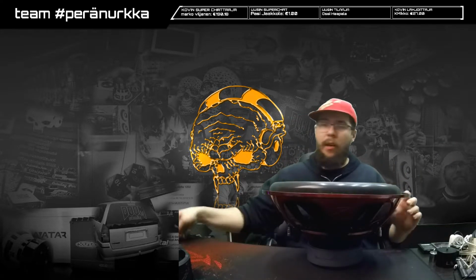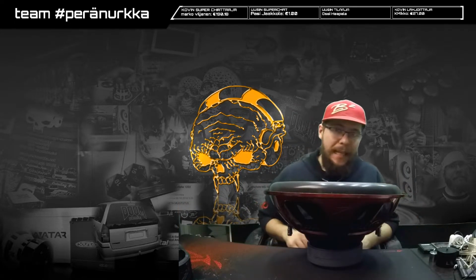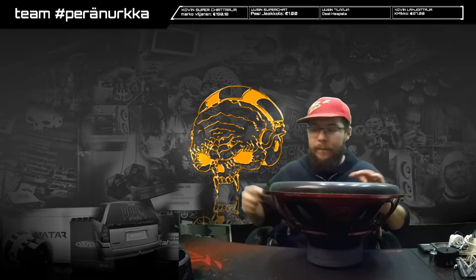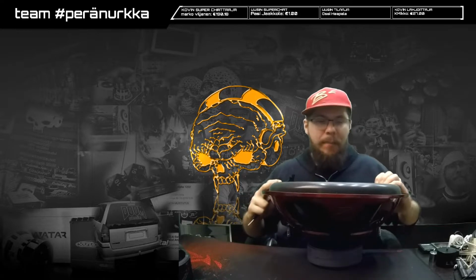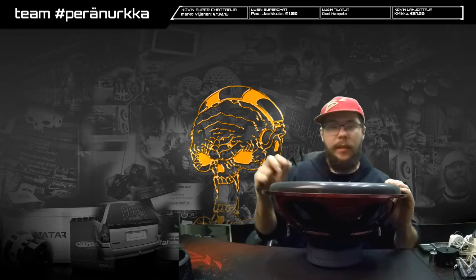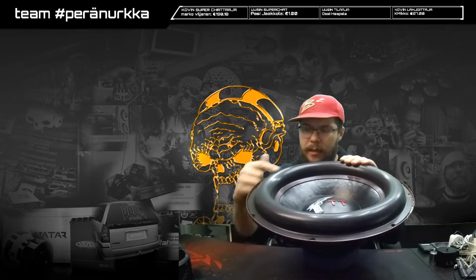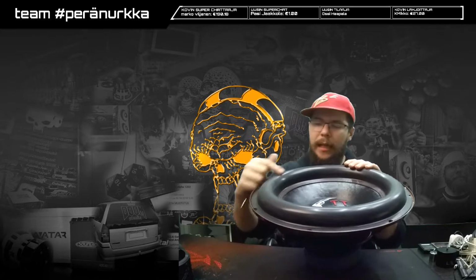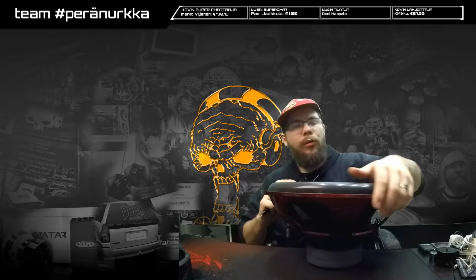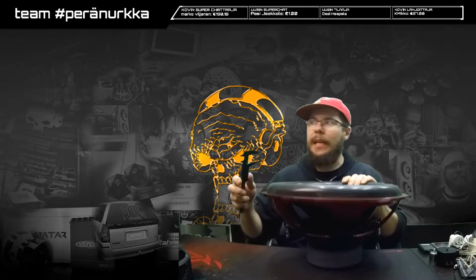Later on in this video, I will be checking some excursion of the subwoofer and some parameters of this individual subwoofer. Now the top surround here is a bit tough. It is quite not that thick. I thought it was thicker, but it's quite tough, and it has this nice rubbery glare on it. It's not fully foam, so it's more rubber than foam. It is quite stiff, but really big and wide.